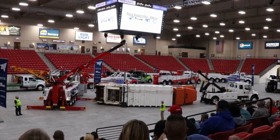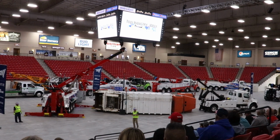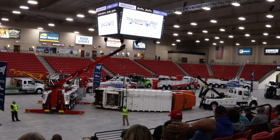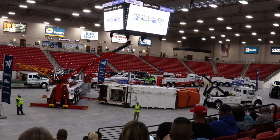So you'll notice that the wheels and tires are off the ground. We've got the truck up on the platform. It's very, very super important. We do this every one of our rotator schools. We go into the test pit, we put the pull meter on the dead man, and we show you this with the numbers in real life. And I'm telling you, when you get this truck off on its platform, off the wheels and tires, this truck will perform 25 to 30% better than it will with the wheels and tires on the ground. You heard it here, folks.